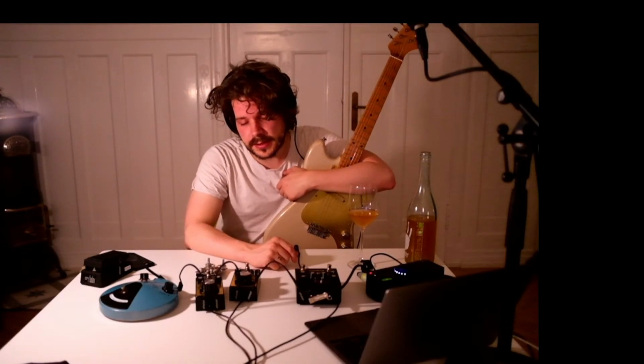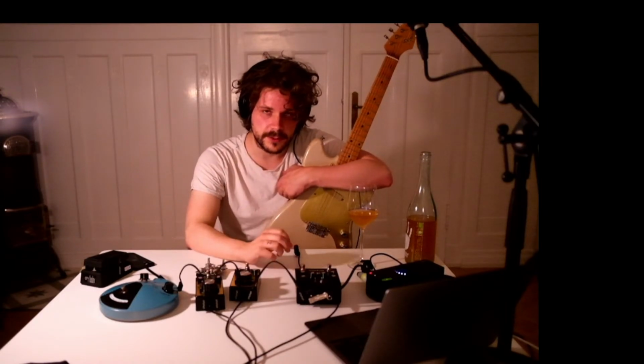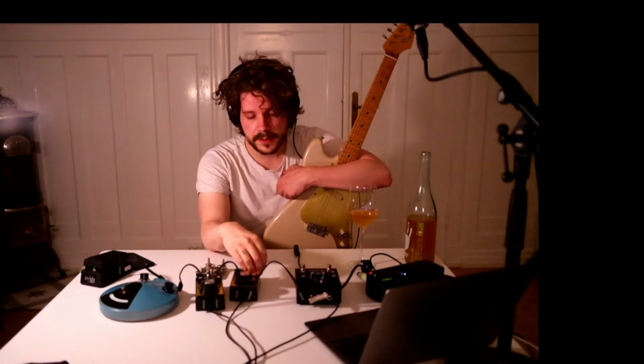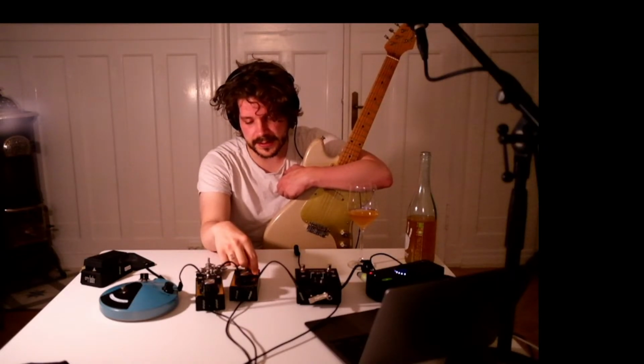And what it does is it fixes a small capacitor at the input of the circuit. So the smaller the capacitor, the less of your bass signal actually reaches the circuit, or at least the active portion of the circuit. And so as a default setting, you have very little. And then you can add in a second capacitor, and that can be a very large capacitor, and it gets sort of added on top of the small capacitor. And two capacitors in parallel get added together. That's how that math works.